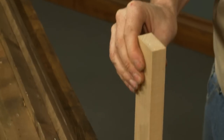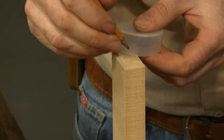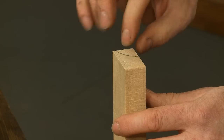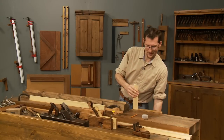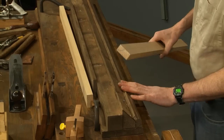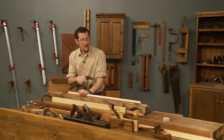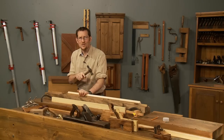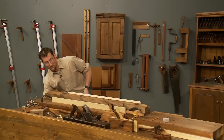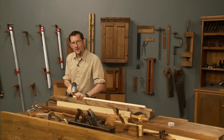The next thing to do is to draw an arc on the end of the timber. I've got a two-inch diameter piece of plastic here which I'm going to use. That allows me to take off the waste very quickly almost to the line but not go below it, because it's defined. The easiest way to hold this wood is to use something called a sticking board. I'll slot it in — I've got a screw at that end, give it a little tap so the screw head just bites into the timber — and put a second screw at 45 degrees alongside the other end. That bites and holds the whole thing solid.